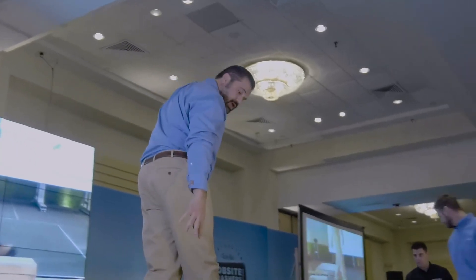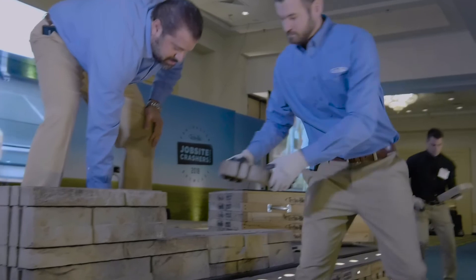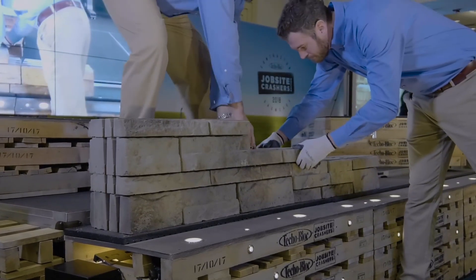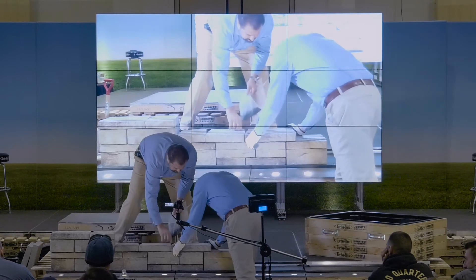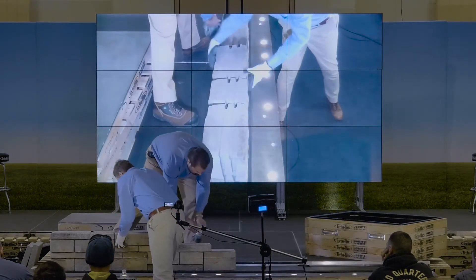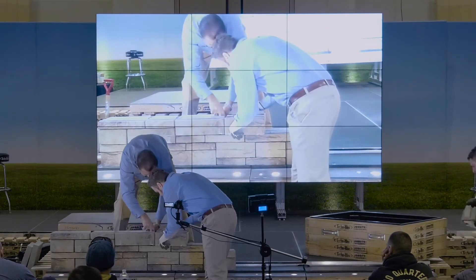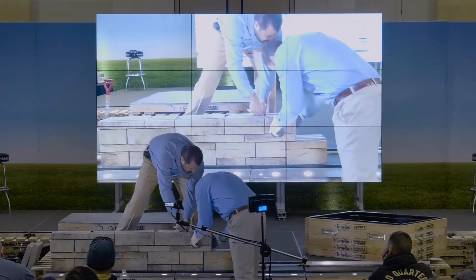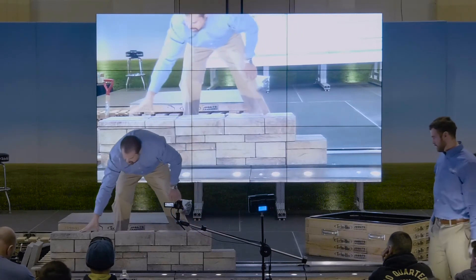Let's go back to ABC again with the thins — we're changing our thickness and doing ABC with the thins. Some of you in the front row can see that I've got two of the thins side by side here — I'm okay with that. I think that adds to the randomness of the wall system. So we've got ABC and we're breaking all our bonds. Now bring me CBA, the opposite — another module of three.